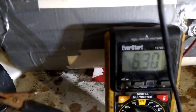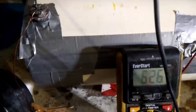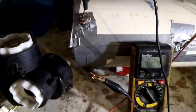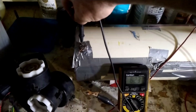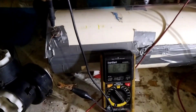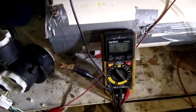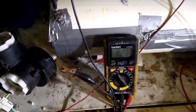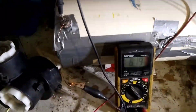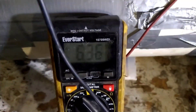These are three motors from the little six volt electric cars for kids. It just ran forever, man. You can see the volts dropping but I have it on like eight times the speed and it's just trickling down. It settled out at about 6.16 volts and I ran it for about an hour, then finally unhooked it — it rebounded up to about 6.42 volts. I'm just amazed by how good this thing did. It just sat at 6.16 volts, it was crazy.